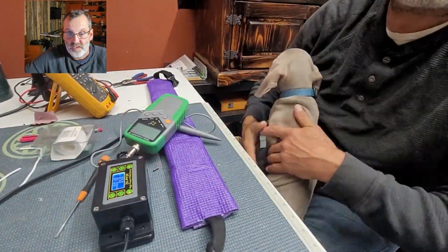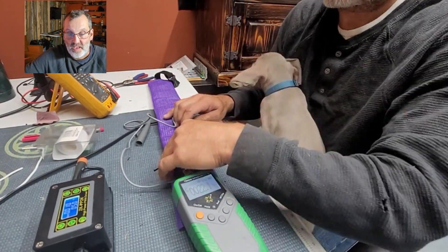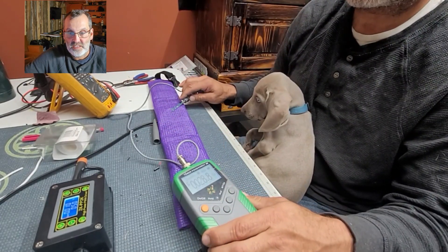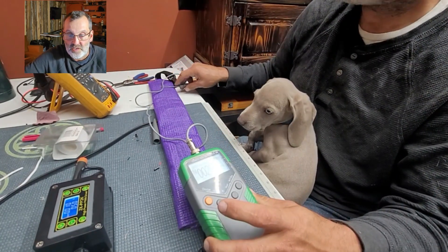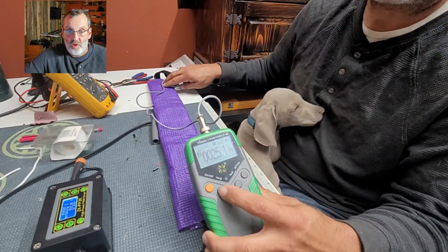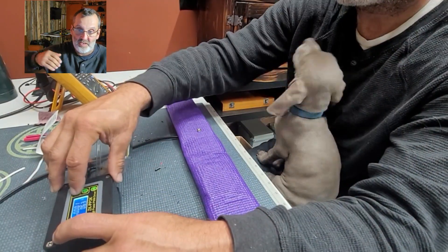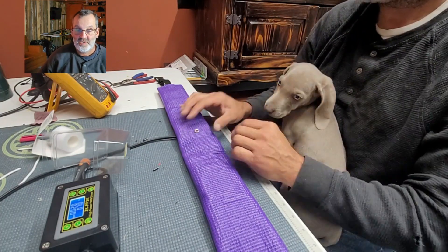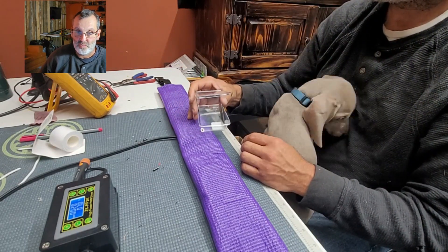Remember we said the formula predicted 50 gauss — we didn't reach that. On one test I'm getting 22 gauss, on another about 28.8 gauss, and at one point I got 29. So it's safe to say they're about 25 gauss per coil. For the head T-PEMF, according to the research, they use 20 gauss — so it's perfectly in range. I always enjoy playing with my magnet.